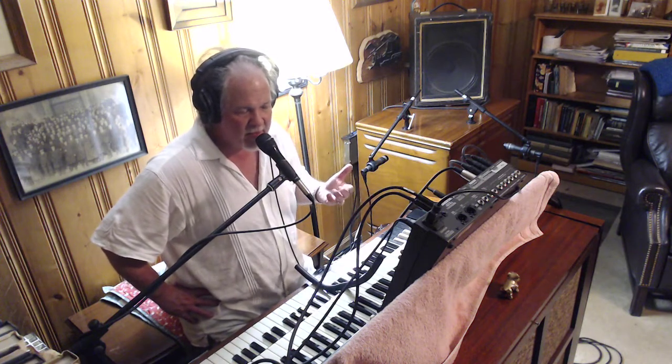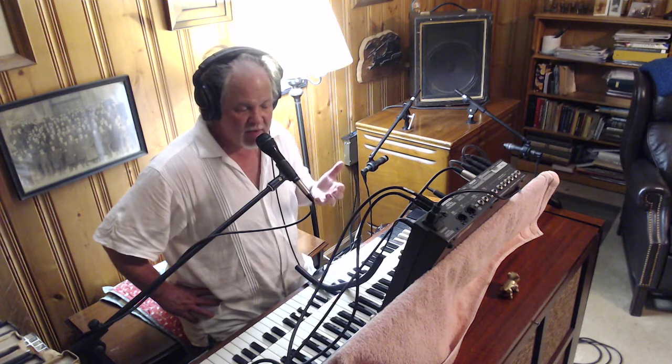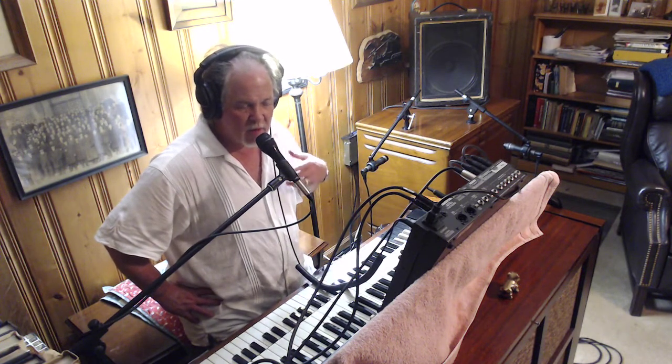But today, Marcus repaired my amp. So I came back and put the amp in, so that means that the preamp and the main amp in this A100, the electrolytics have been replaced, and the few resistors that were bad. So both of those are in excellent shape again. And Marcus also rebuilt my 122 amp that I put in this 145. So all three amps have been refreshed, almost rebuilt.